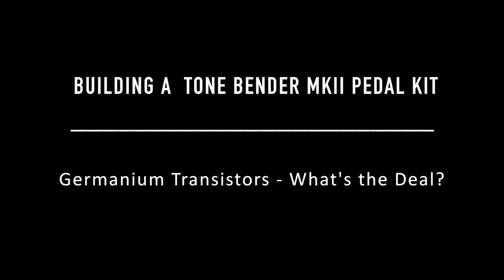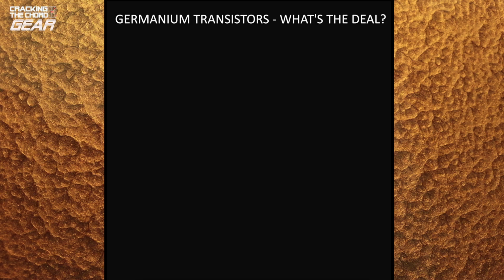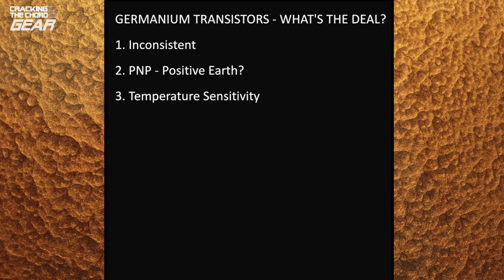With older designs like the Tone Bender, which use germanium transistors, there are particular factors to bear in mind. Germanium transistors are notoriously inconsistent. If you buy from a reputable vendor, you will get transistors matched to the job in hand. Why are they predominantly PNP and hence positive earth? Apparently the physical characteristics of germanium made PNP easier to manufacture than NPN at that time.